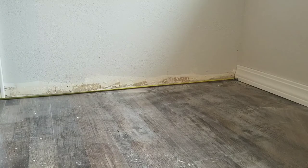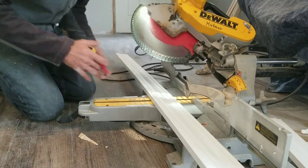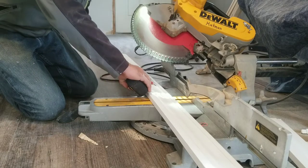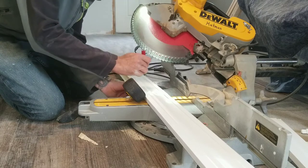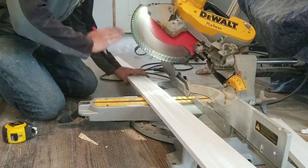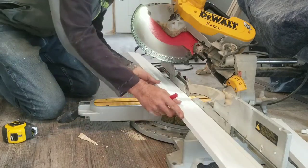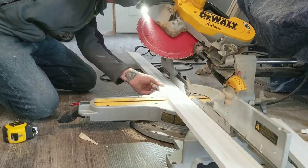I got 48 and 13/16. I'm right-handed so I always work a room right to left so that when I get to the saw everything's ergonomic for me. So we got 48 and 13/16 right along the bottom of the board where it's sitting on the floor. Now you're going to 45 away from that — that's your short point, because the coping part takes all of that out. So 45 degrees measured to the short point.